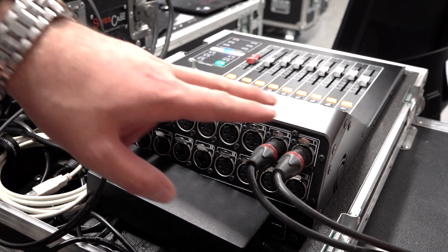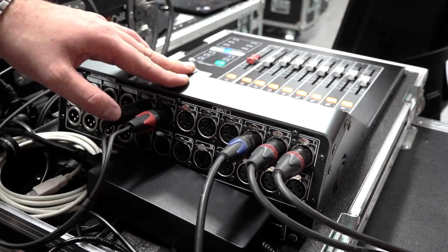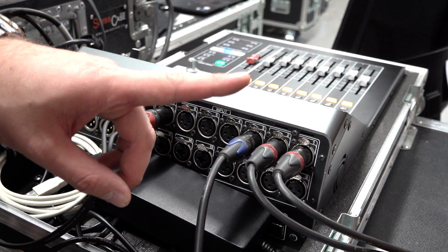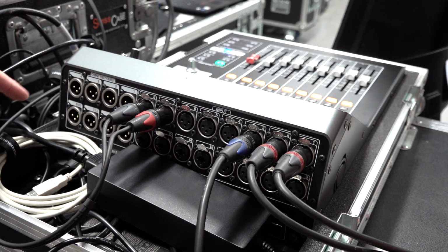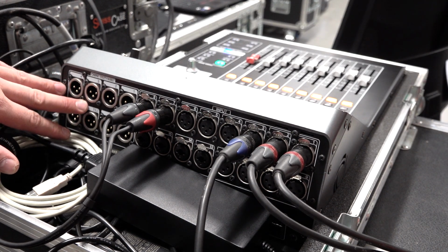At the moment, we have a laptop plugged in as well as the two channels from our wireless microphones. We can now plug in the wireless transmitter from our conference system into an available channel, and all the microphones that are synced to this device will go through that channel. At the moment, we have no output set up, and this is because we'll deal with this when we get to the amplification process, but keep in mind that channel 7 and 8 is usually reserved for our main outputs.